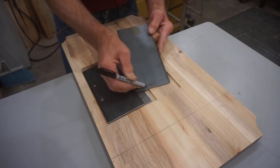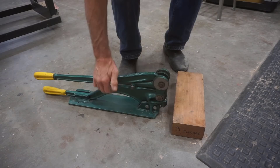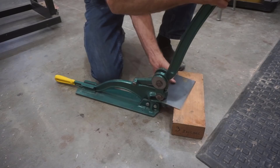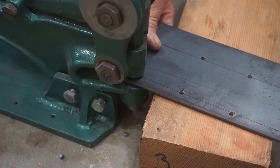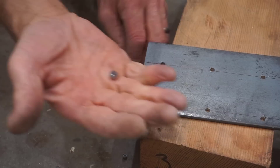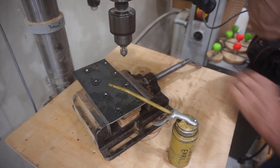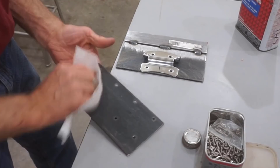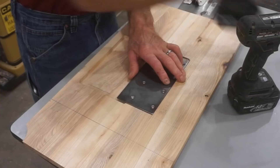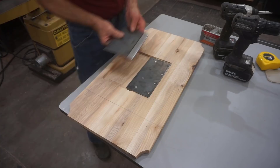Back at the panel, I lay out a series of holes on the other four-inch flat plate for small screws that will fasten it to the back of the mounting panel. I center punch these for alignment, then after switching the die in the Whitney punch, I make quick work of punching eight holes nine-sixty-fourths inch in diameter through the one-eighth inch thick steel. These small dimpled plugs are what the punch makes with its incredible compound leverage. I still have to make an oily mess when I countersink the eight small holes so flat head screws sit flush with the plate. Lacquer thinner easily washes cutting oil off the steel. I use a VIX bit for pilot holes for the number 7 by three-quarter inch flat head Phillips screws that hold the flat plate to the back of the mounting panel and run a few of those screws in to attach the plate.